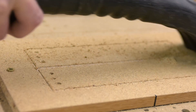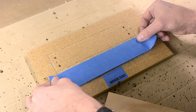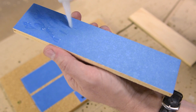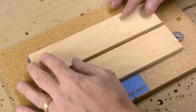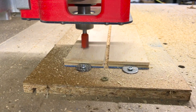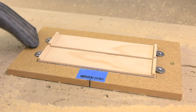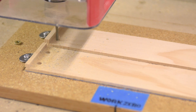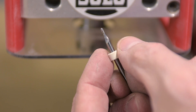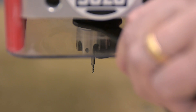Now that this fixture board is finished, it can be used over and over again anytime I want to make pencils. I didn't mention those inscribed rectangles earlier, but you can see why they're there. I'm really loving this super glue and blue tape technique — it's working great. There are my fender washer clamps doing their job. Because I'm machining for thickness, I'm referencing off the fixture, not the top of the stock. That little sticky note is a double layer of blue tape, equal to what is under the wood. The graphite sticks I'm using in this project are 2mm diameter, so either a 1/16-inch or a 2mm ball end mill will work just fine.